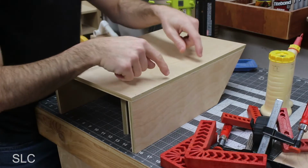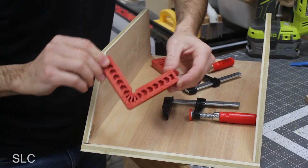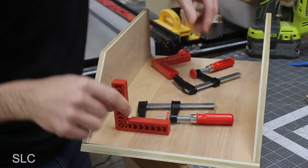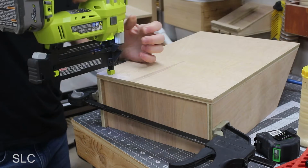Now I flipped it over so I can add a couple more brad nails in here. And while I'm putting these sides on, I'm just using some simple corner squares and some 4-inch clamps. If you're interested in either of these, I'll put a link to those in the description. And then we're going to install the bottom in the same fashion with glue and brad nails.